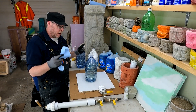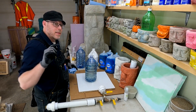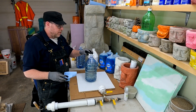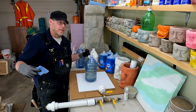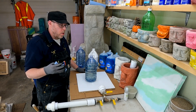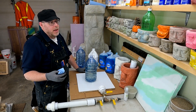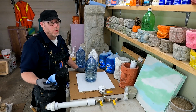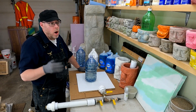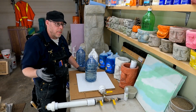Let's talk about water supply for a second. My water supply is disgusting because it's rainwater — there's mosquito larvae and all kinds of fun stuff in there. But there isn't 700 parts per million calcium hardness, which is what my tap water is, which is crazy hard if you know anything about it. And that means if I'm making concrete, I either have to soften the water or buy it, or ultimately just use a water supply with a very high amount of calcium, which has a host of potential drawbacks.